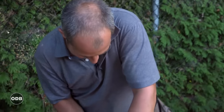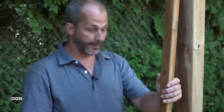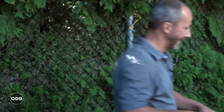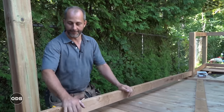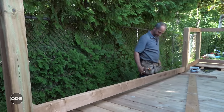These handrails require a banister — little spindle things. Our code in our region says we can't have a gap more than three inches, so we need a few hundred of these. The most time-consuming part is taking all those staples out — I don't know why they put a sticker on every single piece of wood. I like to use a spacer, that's really handy when doing something like this. That's my balusters installed.